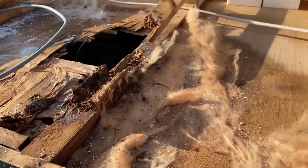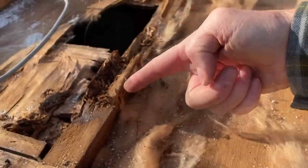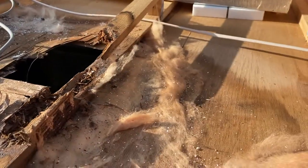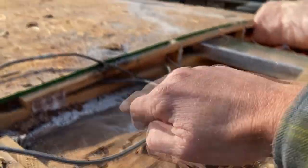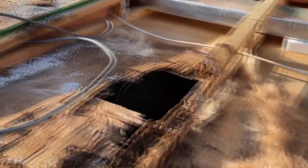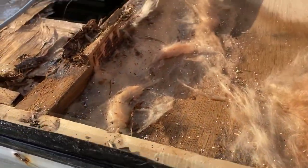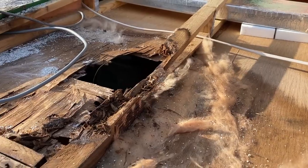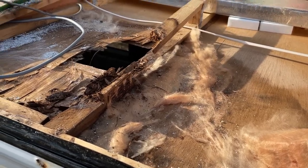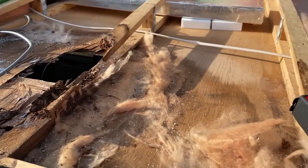You can see where this is rotted out. What I'm going to do is cut a board that'll go from here down to this healthy portion. I'll bring it over, slip it in, and use this pre-existing one to make a template — so I'll have the right arch on it. I'm basically going to scab it in here to this healthy portion, tied into this good wood here, and just leave it next to the damaged section.